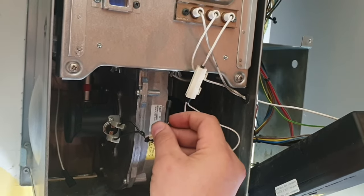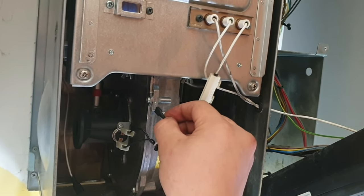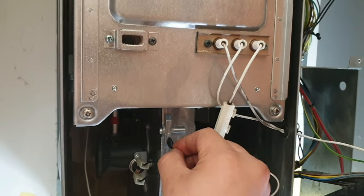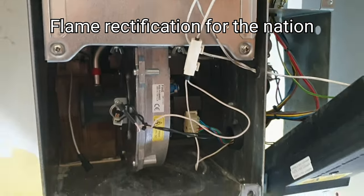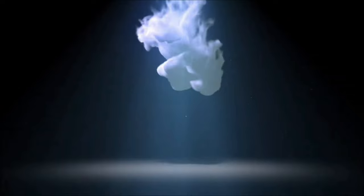So if you find that you've got no blockages and it's not wet, then the issue may be with the condensate trap, the connection on the condensate trap, or it might actually just be your flame rectification.